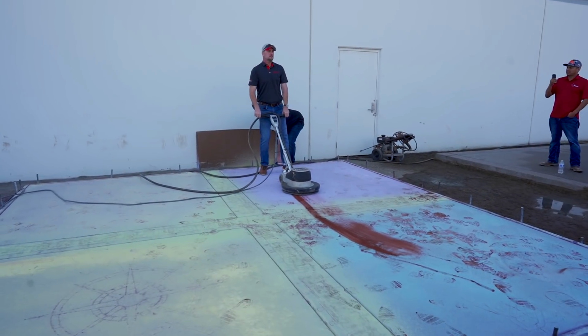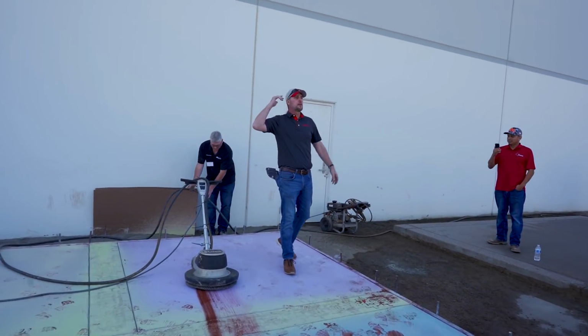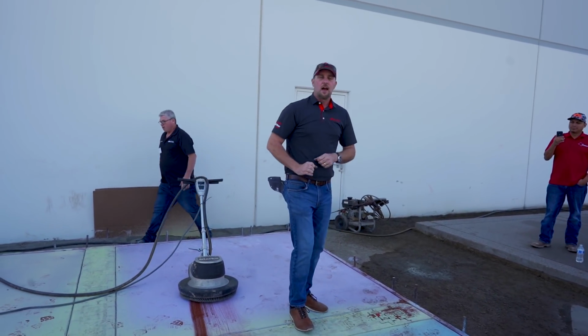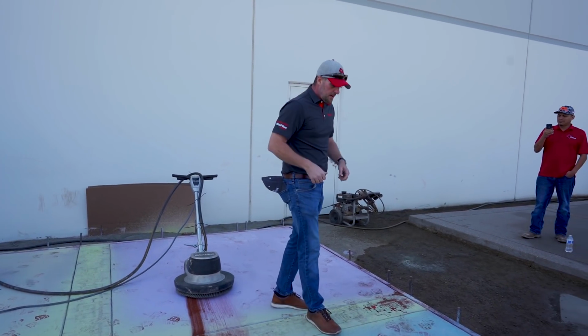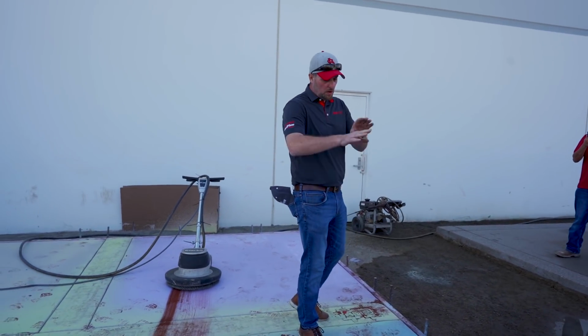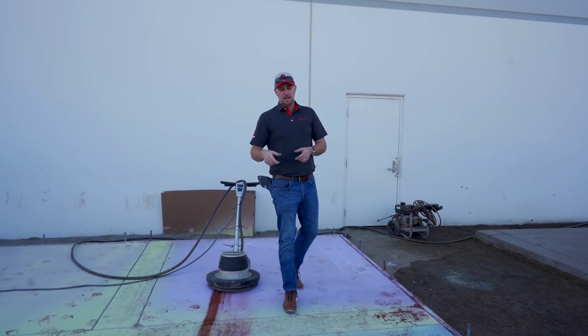Now, why do I do this? Remember yesterday I mentioned that project I did that was 36 feet wide and 3.5 miles long? Having a guy with a pressure washer and a 4-inch tip takes a long time. And when that guy's on his cell phone, the same guy that gave me the electric shock, he's going closer and further away, and you see stripes. And if you don't cross-hatch it and go in different directions, your labor could make this look terrible.